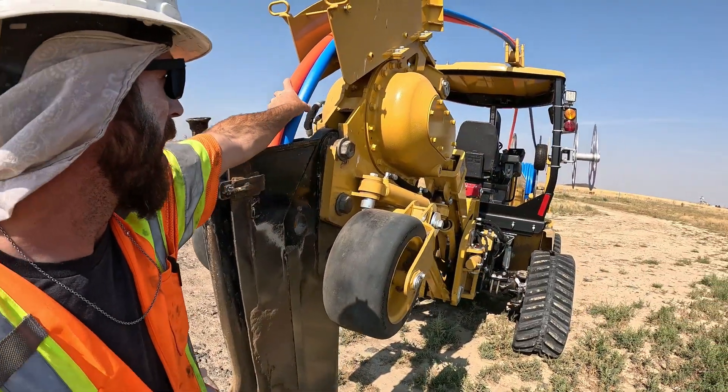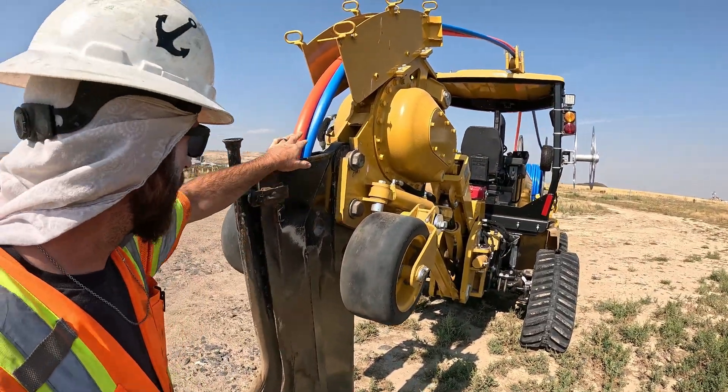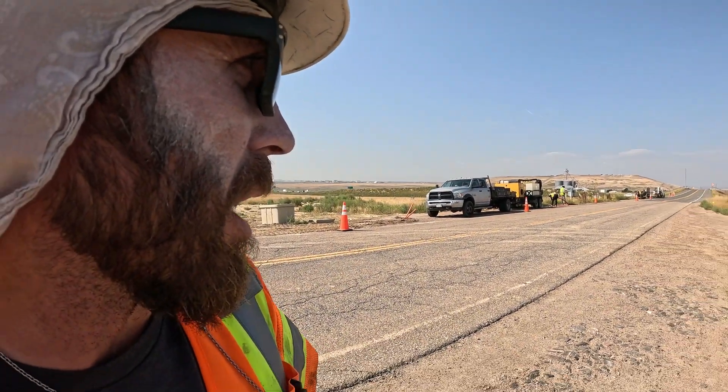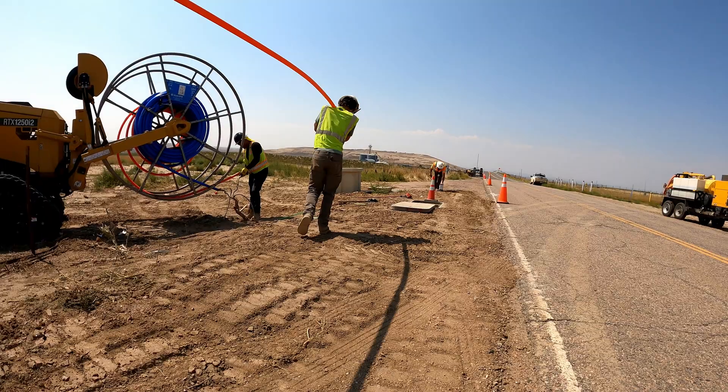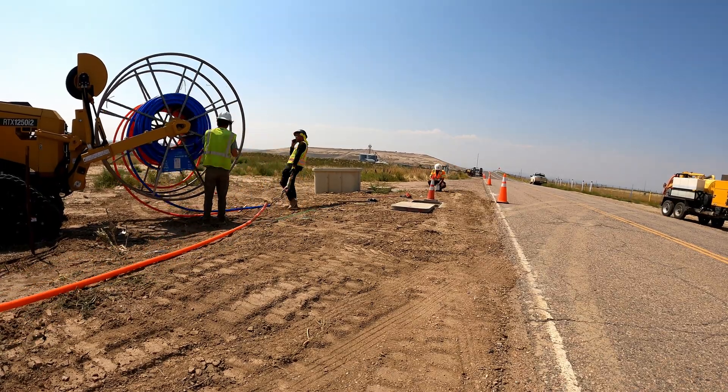See this is the plow. Most of it we've actually plowed in. Some of it we're drilling, but most of it we plowed. Today we're drilling. We have to drill across three major gas lines today, and you guys are sucking out the potholes right now.